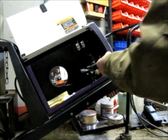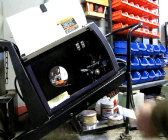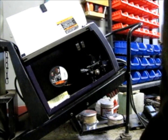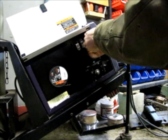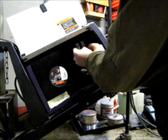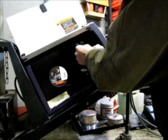Put your screw back on. And since this is going from a flux core wire to a solid core wire, I've got to change my polarity. That's simply done by switching these two leads around — changing which one is your ground and which one is not your ground. They didn't give me a lot of slack on one lead when they built this thing, but put that on the back and put this on the front and it will work.